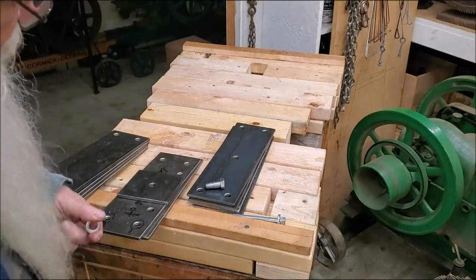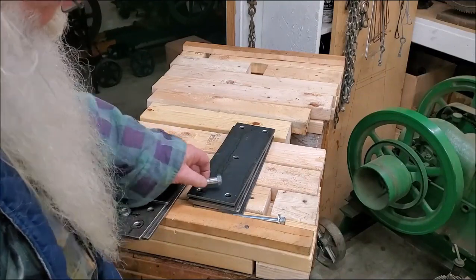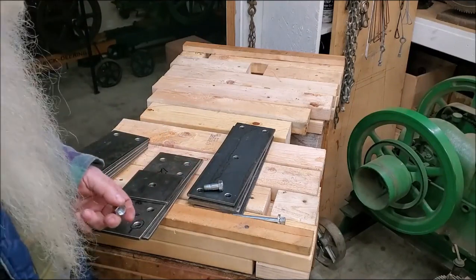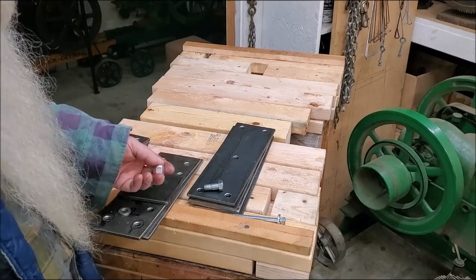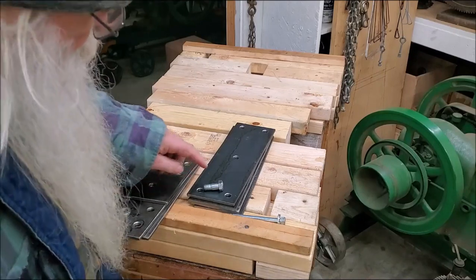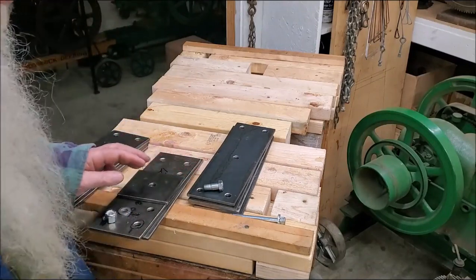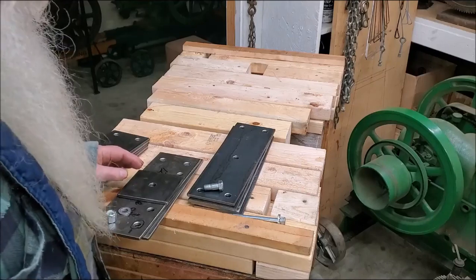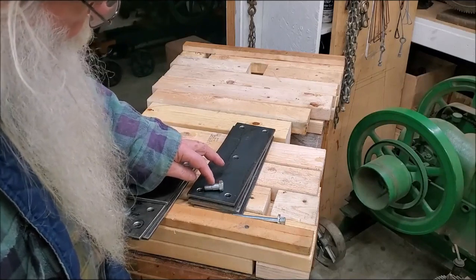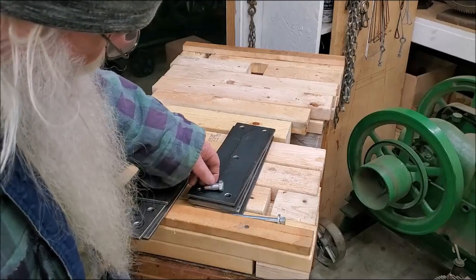You see that bolt right there? If you was to buy a bolt that was just a half inch bolt, say an inch and a quarter long, in order to have enough length to protrude through this lock nut, then you'd have threads going all the way up to that part. So in order to get a bearing surface alignment pin, so to speak, if you buy the longer bolt that has the unthreaded part, then you cut the threads off. And now you've got an alignment section.